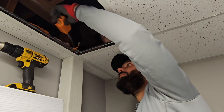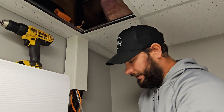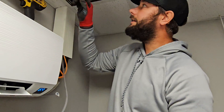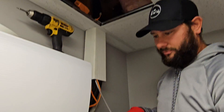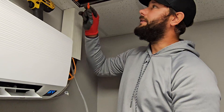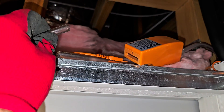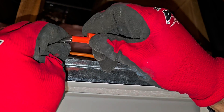I've installed a new tube from the inlet side of the pump down through the line hide cover. Now I'm going to remove the anti-siphon device and install it up here about six inches from the pump. This tube is going to go to the reservoir, so I'll hook it up to the reservoir and then in here. Now we're going to cut this tube and install the anti-siphon device.